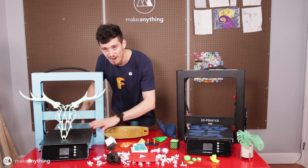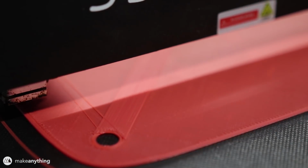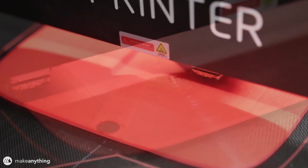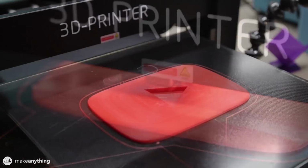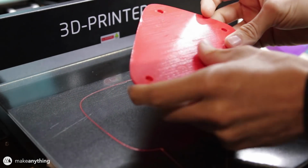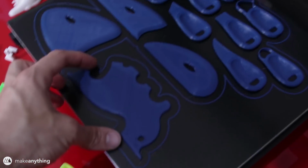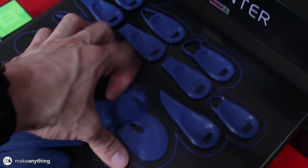It takes like 10 minutes to put together. It's got this awesome build plate material. They call it a black diamond platform, but as far as I can tell, it's exactly the same as the i3 Mega's ultra base build plate, which is awesome. Everything sticks to it really well, and then as soon as the build plate cools down, the prints just pop right off. I really love that about it. And it's also really nice and flat, so you can print on the entire build volume and your print will stick down.